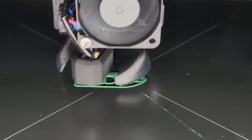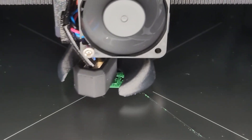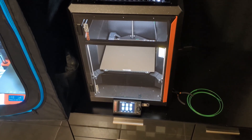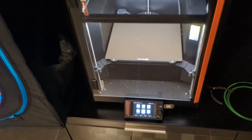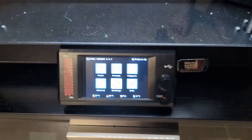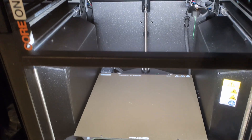Ultimately, this is a fantastic printer with good quality and fast print times that I have enjoyed quite a bit. However, after using this for a while I have noticed a few issues. One of the main issues I've seen is the limited access to the top — the only access to the inside is through the front door. This is fine for removing prints, but challenging if you need to work on the extruder. An issue I've encountered frequently is brittle filament breaking off in the PTFE tube.